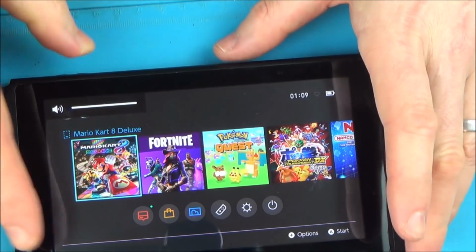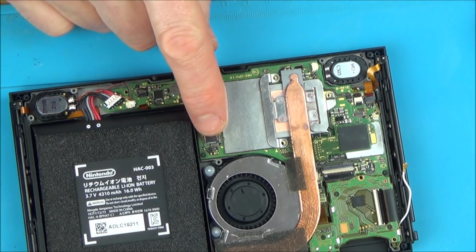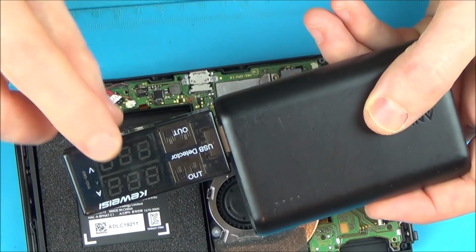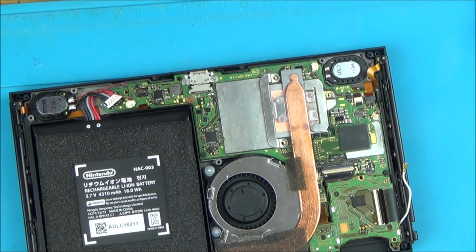It was the backlight. Well, it wasn't the backlight, it was, obviously, this chip here in the end that was faulty, along with all the other things, because, remember, it came up to 0.4 amps, which is what it should be reading, but I didn't see anything because the backlight wasn't plugged in.